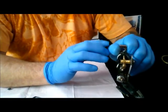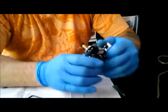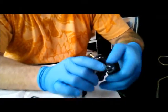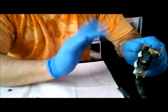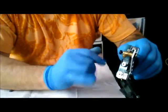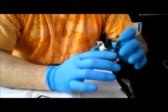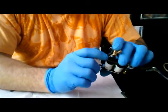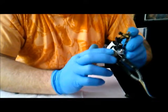Just get that figure eight, get that spring at 2, get your spring tension right, do a test with downward pressure with the nail or right in here, at a voltage that's just going to be enough so that machine isn't going to stall out or stop, okay? Get the right spring on your machine, short front spring, short rear spring.